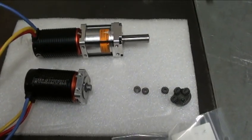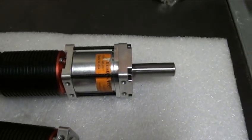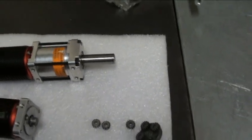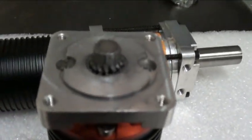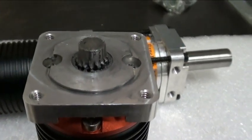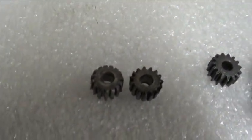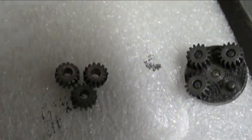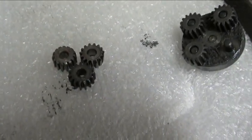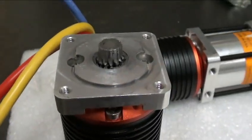Here's the aftermath of the wheel lockup. The setup was the TrackStar motor with a Banebots P60, 64-to-1, and there was a further 2-to-1 stage chain reduction to the wheel. This is the one that locked up. You can see those teeth are pretty much gone. These are the planet gears — here's a good one right next to it so you can see. The teeth are pretty rounded, and the aluminum ring gear got chewed up a little bit.